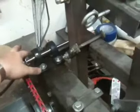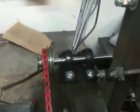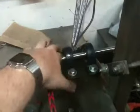I definitely had some noticeable wobble when I took the belt off and just ran it by itself. This wheel was starting to wobble a little bit, and there was definitely noise coming out of the bearings. Not so much a squeaky sound or a grinding sound, but just a little bit more rattling, a little bit more vibration. And I think the source of the problem was ultimately probably the bearings, but it did manifest itself in the drive shaft as well.